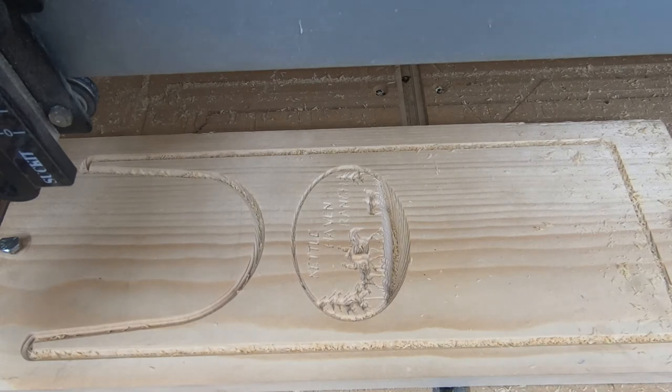For now, we're going to do our final cut. Before I do, I want to note the tabs — just like with old plastic models where you had tabs holding pieces together, the same thing is going to happen here. But instead of doing it off the bottom of the workpiece, I've had to move the tabs up because we've already done a chamfer on the other side. With the default setting there would be no wood there to hold the piece, and it would flop around and be ruined. So I went into my design program and changed them to be half an inch tall instead of a quarter inch tall, so they reach up where there is still wood from the outside frame to the actual product. Let's finish this cut.